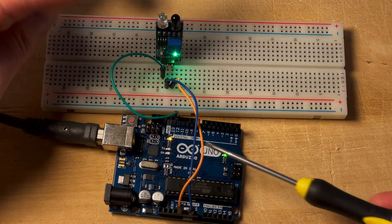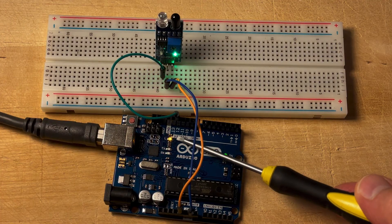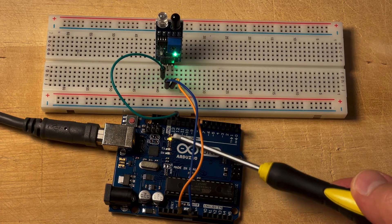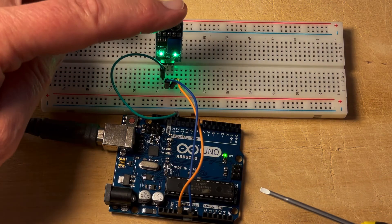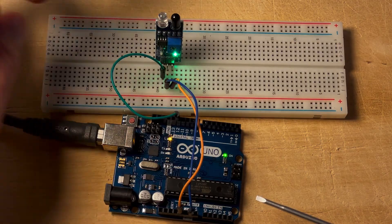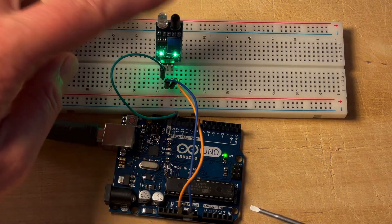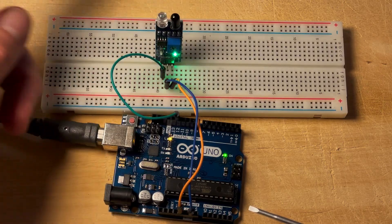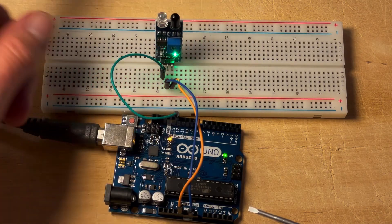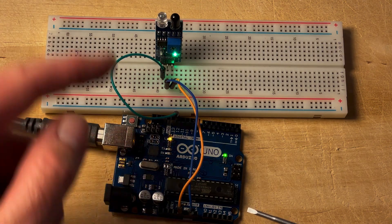You can also see that on the Arduino the built-in LED, which is on pin 13, is directly connected to that pin. You can always use that very conveniently to test your sketch on the Arduino. This LED turns off when I put my finger in front of the sensor — so every time it detects an obstacle, the LED goes off.